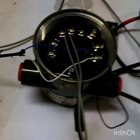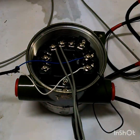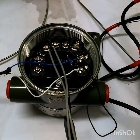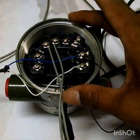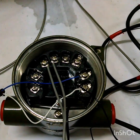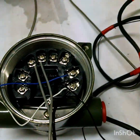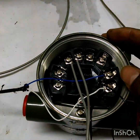That's why normally we use compensating cable up to the transmitter, or in DCS where the thermocouple cards are. Inside this transmitter you will find one thermistor. The thermistor measures the inside temperature of the transmitter, and it will compensate the output of the transmitter if any temperature variations come at this point.